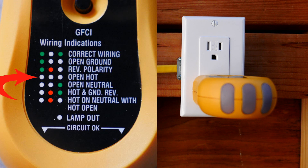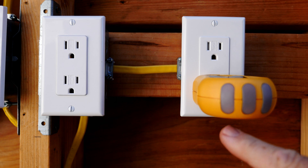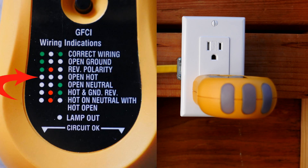That's why this situation is extremely dangerous. If you are not very experienced with electrical work, my recommendation is to call an electrician because this one is really dangerous. It's a situation where you can open up this box thinking that the electricity is off because there's no indication on your tester, but actually there is — it's no lights, and that means open hot.